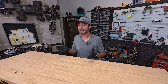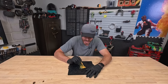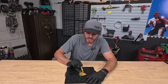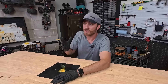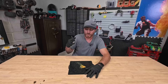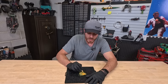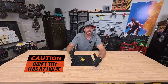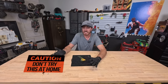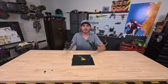While it's in its liquid state, it can be quite useful. It's important to note that as the acetone evaporates, these fumes are acetone fumes. Make sure you're in a well-ventilated area with fans going. It may be important to wear a mask. Also, the fumes coming off are likely going to be pretty flammable — you don't want this to catch on fire. Make sure you have a responsible adult with you if you're trying anything like this.